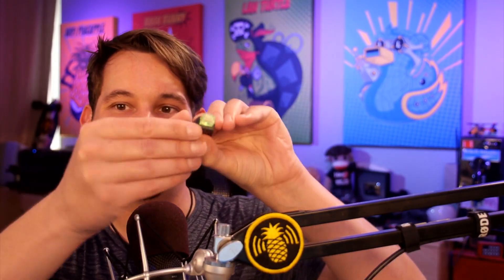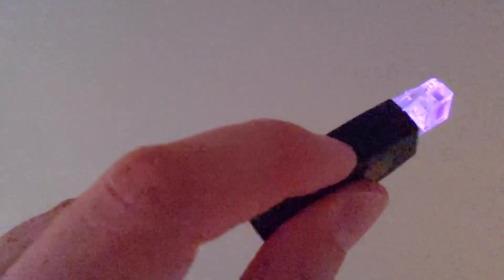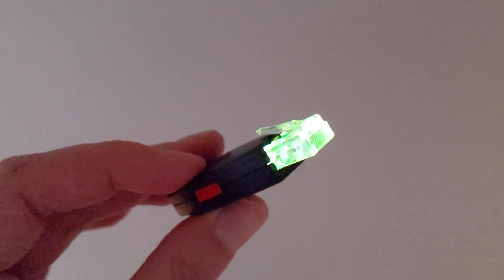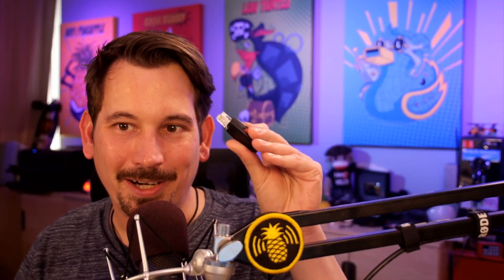I'm really proud of what we came up with. One of the coolest aspects of the design — as I hold it here blinking for you — is that we're actually using the RJ45 jack as a light pipe, which I thought was really cool. That way you can see the red, green, blue LED. And you actually have a jack, not a port — in the same way you have a jack on any USB device, you've got a jack on an Ethernet device. You're not going to find one out there; they're not SMT parts, so that took a little fun industrial engineering.